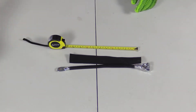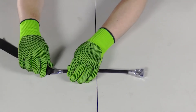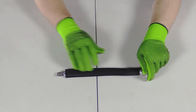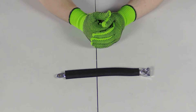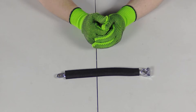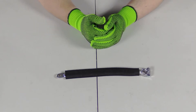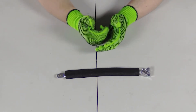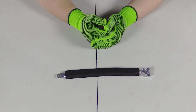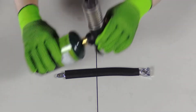I'm going to put away the excess for future use and get rid of the tape measure. We're going to want to slide on the tubing and then shrink it down using a heat gun and not an open flame torch. You can use an open flame torch, but the high heat of the torch, if it comes into contact with the tubing, can melt it. It's only designed to have an operating temperature of 125 degrees Celsius and a shrink temperature of 135 degrees Celsius, so if you put a flame that goes to 1,300 degrees Celsius, it's logical that it will melt. So I'm going to grab this propane heat gun from Pico and get shrinking.